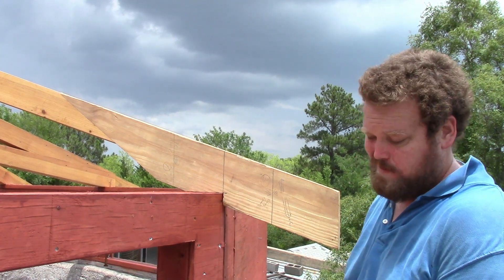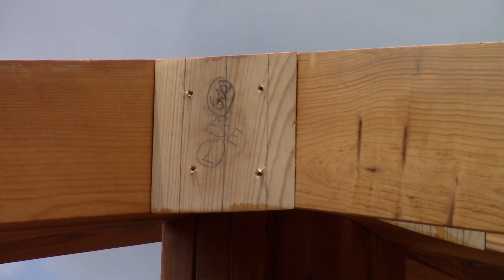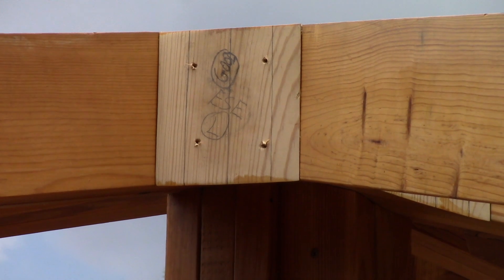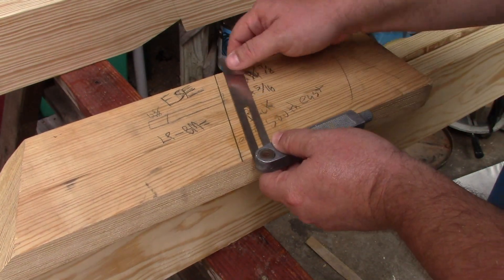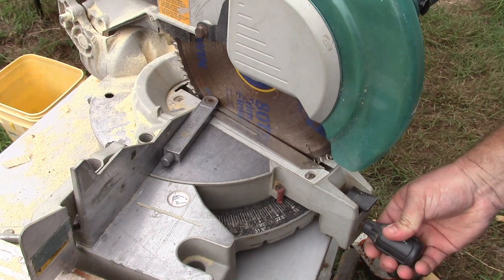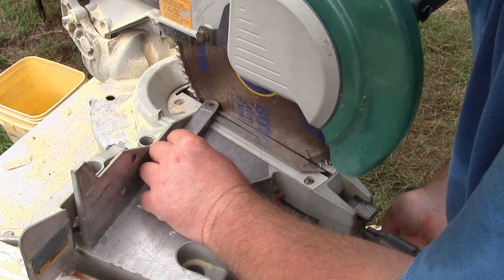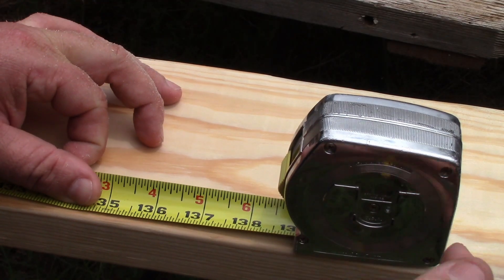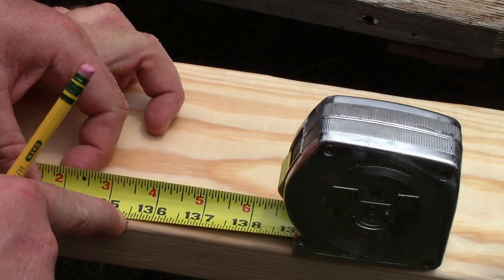Then I build them off of these little scribblings here. Because the angle was so steep, we decided not to butt the rafters up directly in the corner. We built little blocks and we're butting them up flat against those blocks. So the first thing I do is I transfer my line back to my tool, and then I put that angle on my saw. Alright, 135 and a half from the long point — double check — 135 and a half.